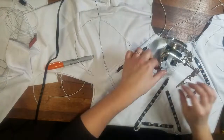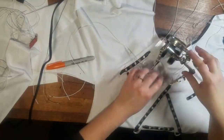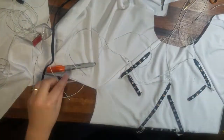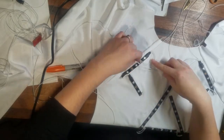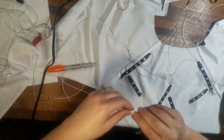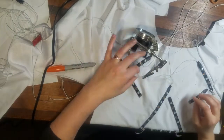I used pins to create the wiring channels and make sure that even if the garment stretched, there would be enough extra wire. While creating the channels, I soldered the LED strips on the back of the garment to connect up with the board on the forearm of the sleeve. I also connected the three 5-volt and ground solder points from the three different strips so that there was only 5 wires running down the arm instead of 9.